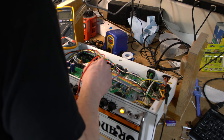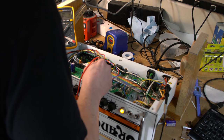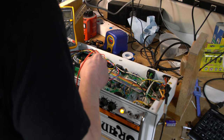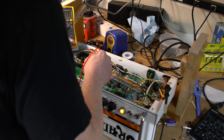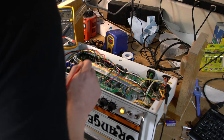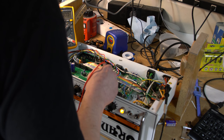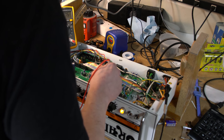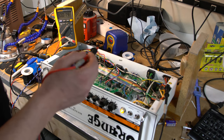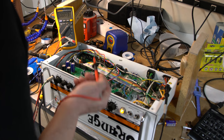I'm getting 141 there, and 154 on the top — it should be a little higher, around 225. These are the anodes. The schematic does list a lot of test points but not what the voltage should be, which is a bit of a weird schematic. Getting 0.8 volts at the cathode on that one. I'm getting a little noise out, which means it's working. Everything looks happy — nothing smoking, burning, or flaming. He said it does work.